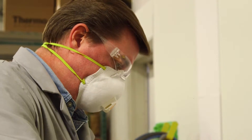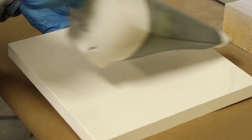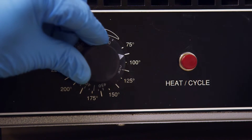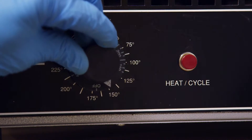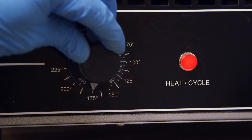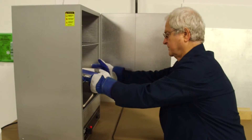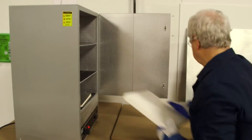That can be cleaned off by vacuuming the part surface or using an air blast to get the dust off the surface before spraying. Heating the ceramic in a dryer to 150 to 200°C, or about 300 to 400°F, is again the best method for making the atomized boron nitride spray adhere well and dry quickly.